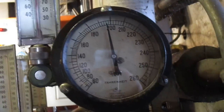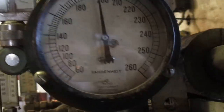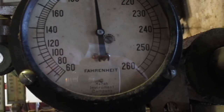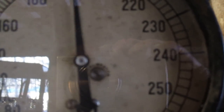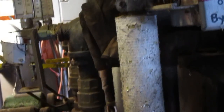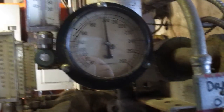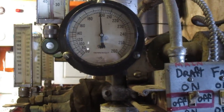It'll go up to probably 200 degrees and then the house will call for it again. But if I had a big bed of coals like you run all night long, then it overheats from time to time. We're up to about 198 — it looks like it's starting to level off. The house will probably call before it goes to the dump zone. If you've got a boiler with an overheating problem — which I don't really consider too much of a problem, it's just the way it is — I'd recommend putting a dump zone on it just so you don't boil.